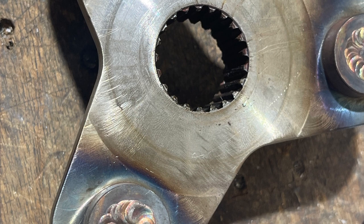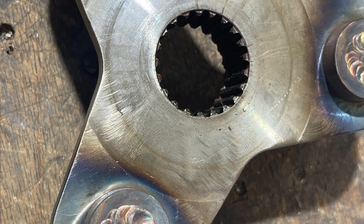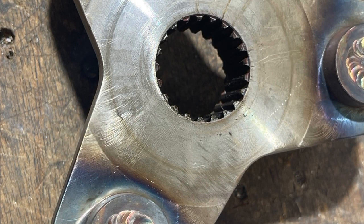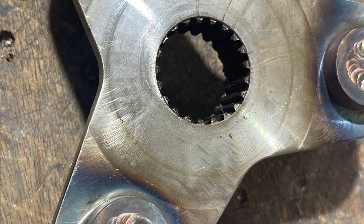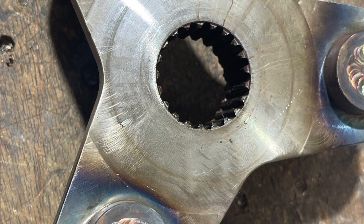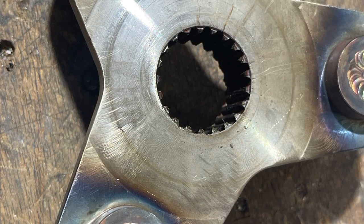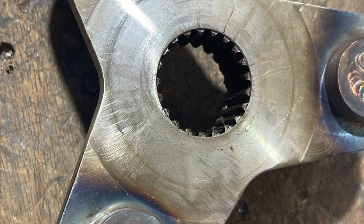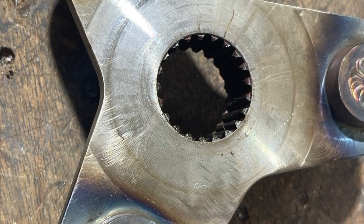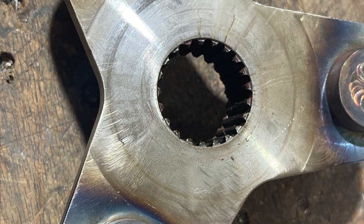Any speculation by people not in the know about the design of the gearbox, that the parts are not strong enough and there are fracture cracks and welds that are not adequate, and all that, is not correct. The parts are forged. The welds that hold the dowels in are only there. They're professionally done and there are no cracks in the welds. The drive couplings are used on much, much more powerful engines than the 110. The issue is the part touching the back of the gearbox. The repeated hitting by the part making a groove in the housing is what eventually will make one ear fail. And it has nothing to do with any other speculation about the part.